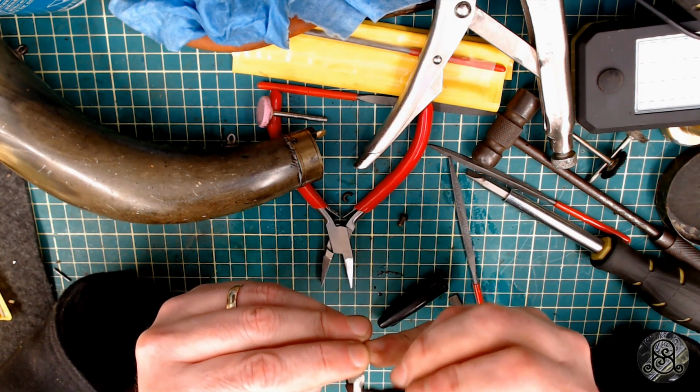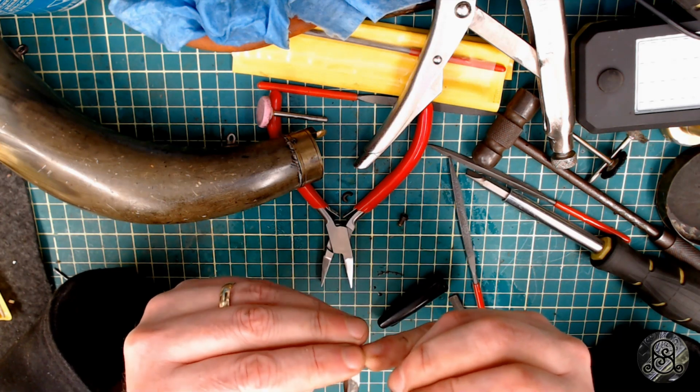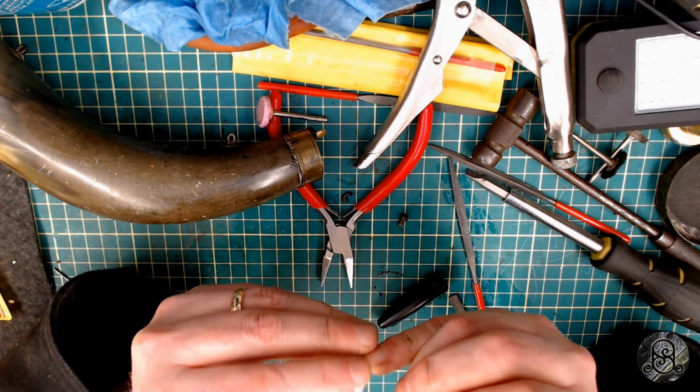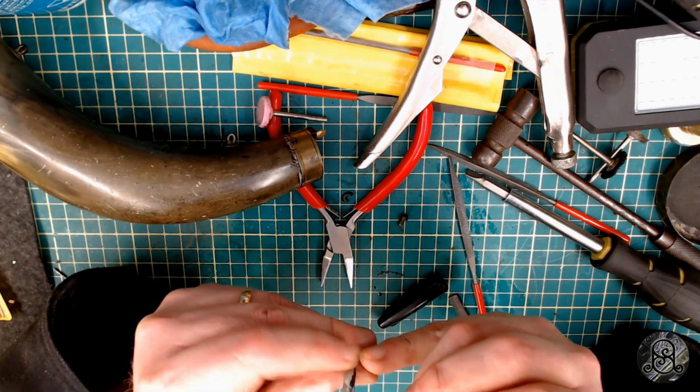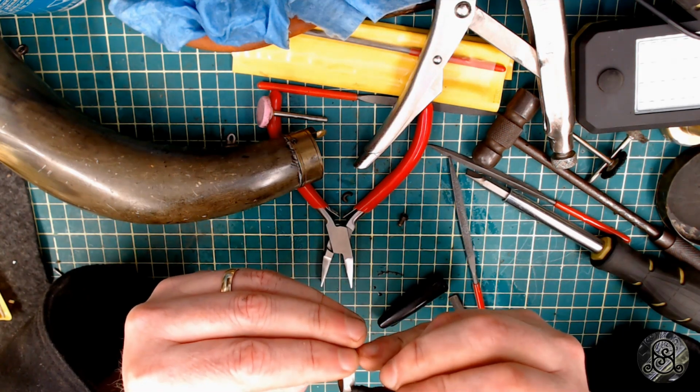When it comes to just roughing out the material, I'm just going to take it over to my grinder and do that real fast. Nothing much to see there other than it gets really damn hot when you grind things like this. Do keep in mind it is spring. Spring will lose its tension before it hits cherry red.